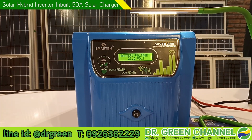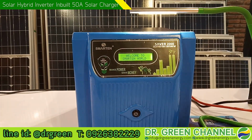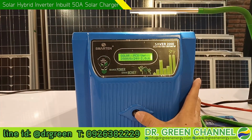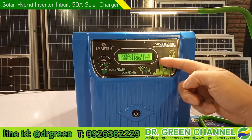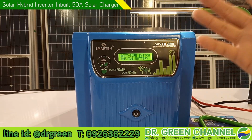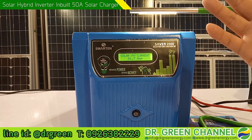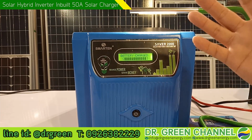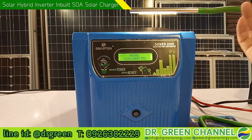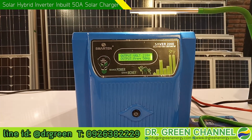It can also work as a hybrid solar UPS at the same time if you connect both grid power and solar power. For example, when I switch on, it will show the status like this. Input range: it supports down to 90 volt input, because this is designed to collect the power from the grid even when it is as low as 90 volt, but the supply output from this inverter will be about 220 volt to supply your loads. So this is very good to use as a hybrid solar inverter and also as a UPS.